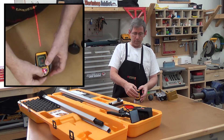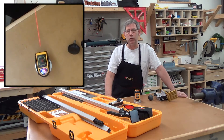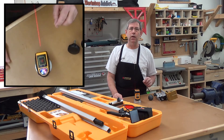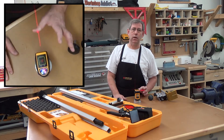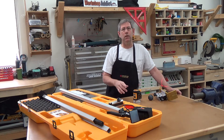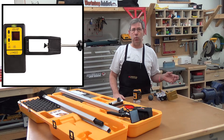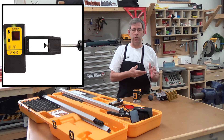The button here is an indoor/outdoor mode button and that also works in conjunction with their laser detector. This unit is good for 10 meters — roughly 30 feet — with accuracy within an eighth of an inch, which is on par with most other lasers on the market in this price range. The unit can be purchased with an optional laser detector which would extend the range up to 25 meters and give you audible notifications when you're on the target.